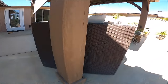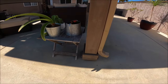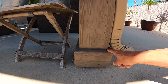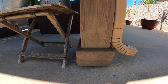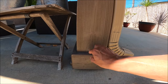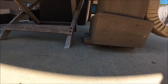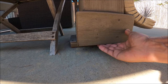People asked how many anchors do you use. In San Diego, I decided to just go with one anchor on each foot. What I did personally is I took outdoor caulking — the 3M stuff, it's like a $10 tube. These were done two years ago and they still look perfect. There's no cracks and when it rains, no water gets in there. Fortunately this is the lower side sloping, so I put a little block down here painted the same color so no water gets in.